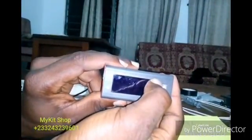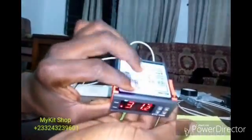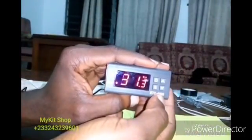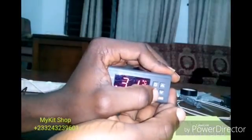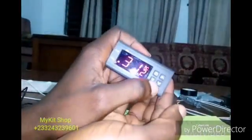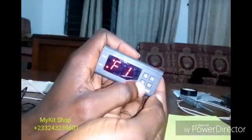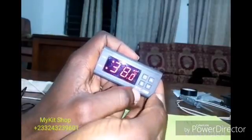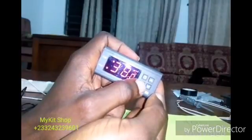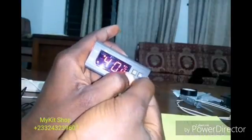I'm going to turn this on. My temperature controller is now on. To set F1, I'm going to press and hold the S button. Press and hold — you'll see F1. I'll press S once, and it's set to 38. I'm going to take it to 40, so I'll press and hold S and then use the arrow key to increase it to 40.0.